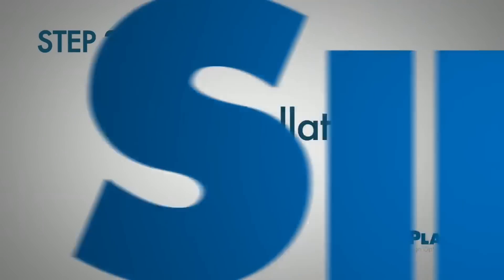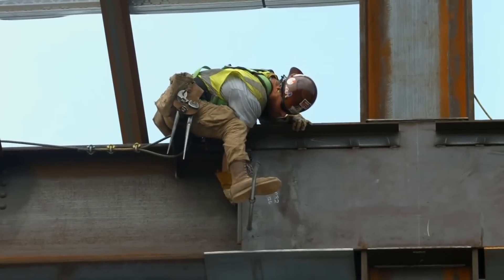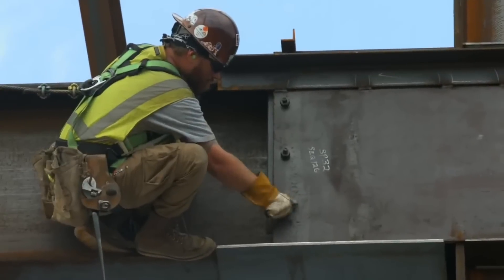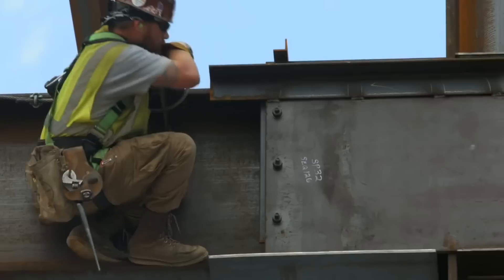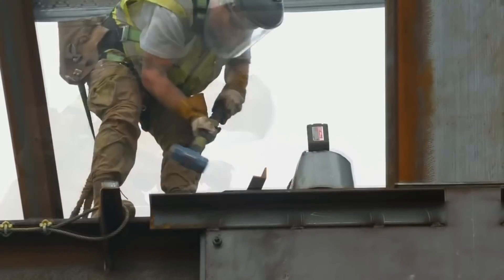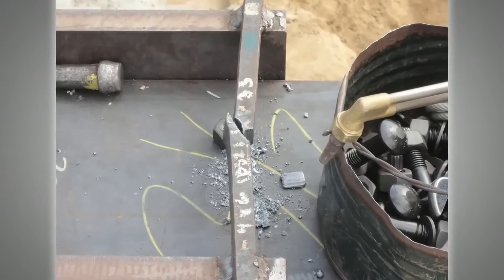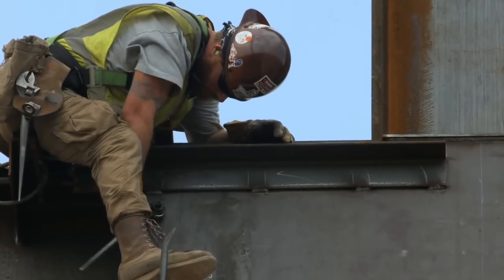Bolt installation is a vital step in the fieldwork for side plate connections. Once the moment frame columns and beams are in place, the next focus is on inserting bolts to secure the connection. The bolts used are typically A325 bolts. The installation process involves inserting the bolts through the horizontal short slotted holes in the vertical angle and the oversized holes in the side plate. The number of bolts required at each end of the beam is usually determined by the weight of the beam, with six bolts per beam being common in most projects. The bolts also act as clamps to effectively close any root gap that may exist between the interior face of the side plates and the longitudinal edges of the top cover plate.